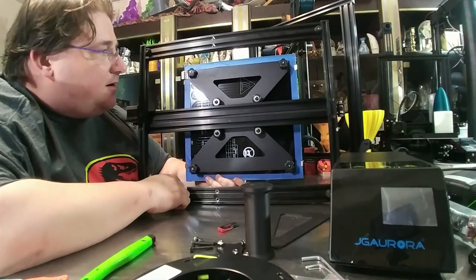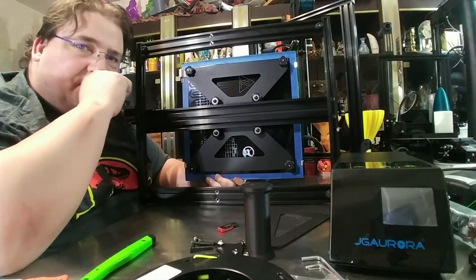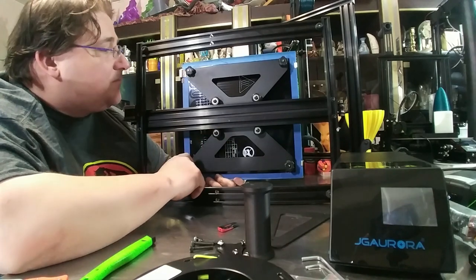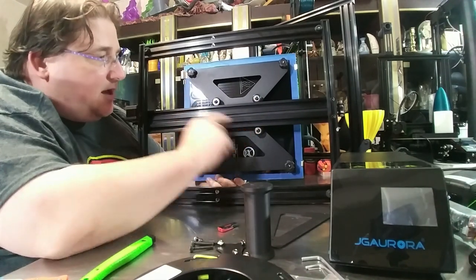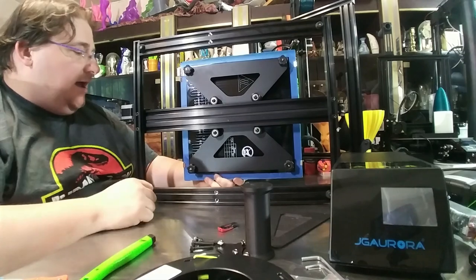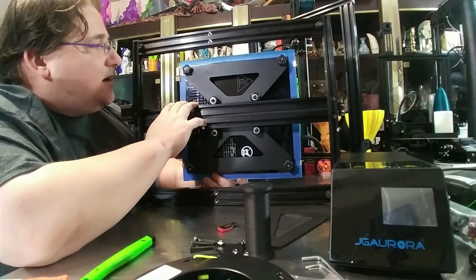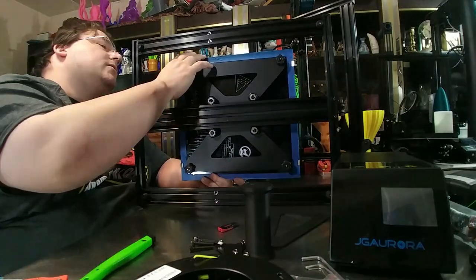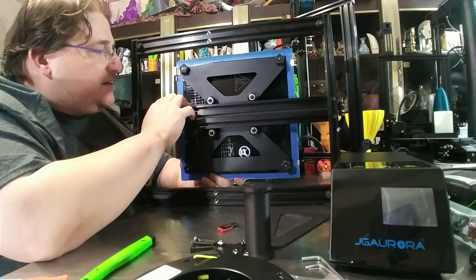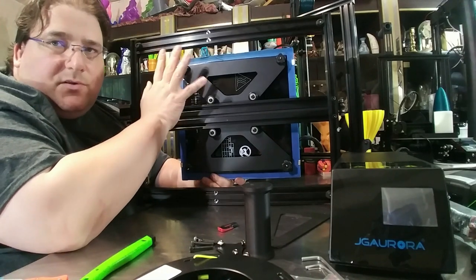Interesting differences with their printer. They do have custom knobs, but they're small, so I will probably replace them with larger knobs. You can actually buy the new Ender 3 style large knobs on Amazon for $10 a set. Four wheels, two adjustable. I do like the fact that the rail is sideways, so you get them more spread apart, which should make this arrangement of wheels a lot more stable. It also means the belt is running parallel on both sides, so that should take care of eccentricity issues. The carriage plate is nice and thick. It looks like it is an aluminum plate with glass on top. It uses the same ultra-base style surface that the A5 uses. Not too fond of this connector here, although maybe the amperage will be lower at 24 volts and it won't be a problem.